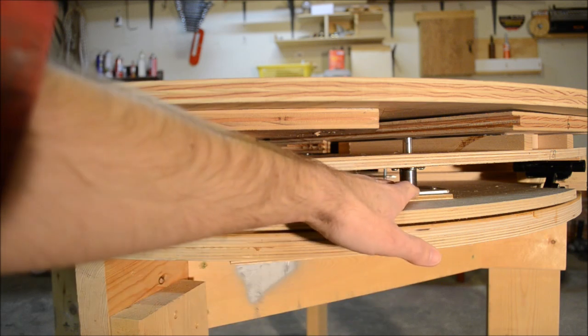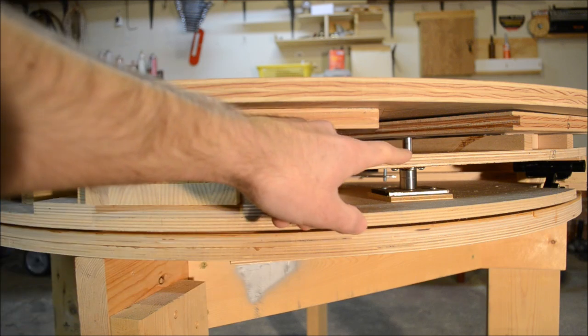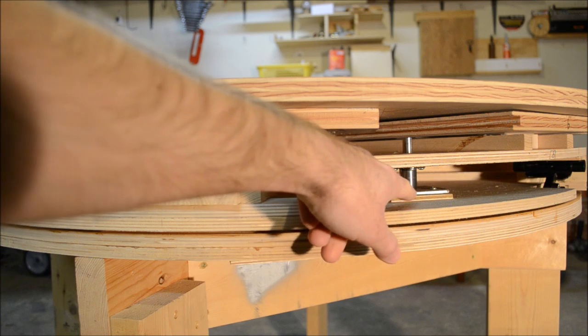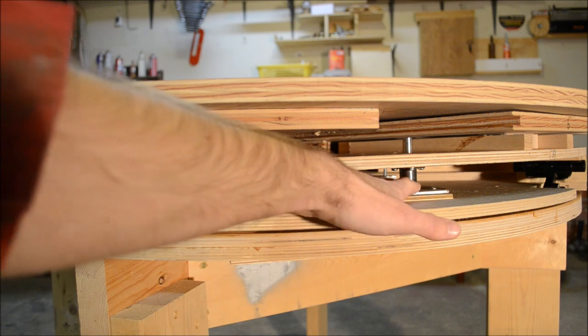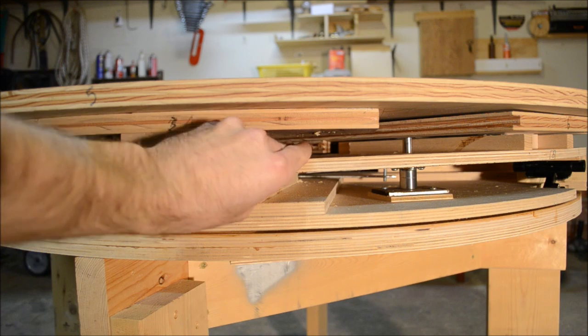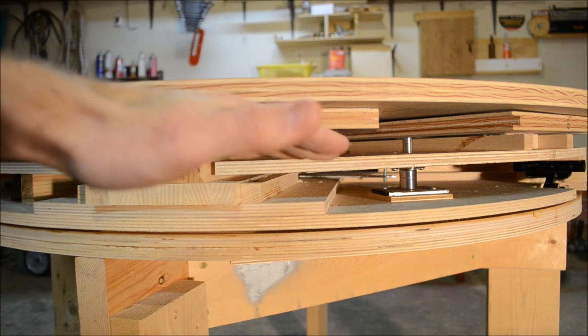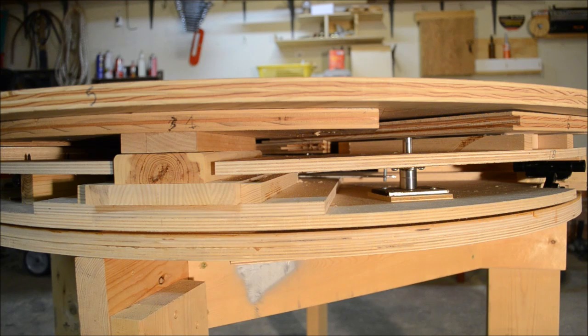This piece is a linear bearing. The way that works is that the hardened shaft sticking up is welded to a flange, which is then attached to this lower level. The fatter piece is the bearing which rides on that hardened shaft, and that just keeps this lifting level properly aligned — aligned in X and Y, but it can go up and down as it needs to.